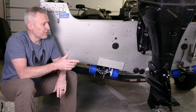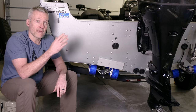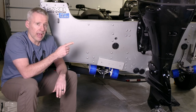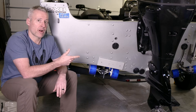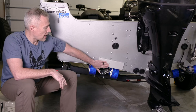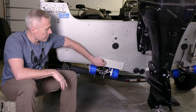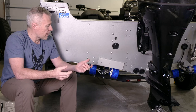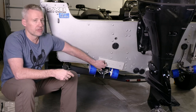On this 18-foot aluminum boat, we're trolling off the main outboard. Over on the starboard side, I've got a swim ladder and a multi-frequency sonar transducer. So in that scenario, we're going to put the Fishhawk over here on the port side. I've already mounted one of these transducer boards on the back, so now we're going to go ahead and install the transducer onto the board.